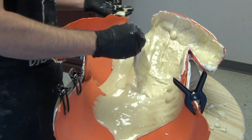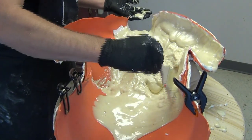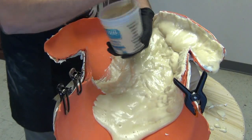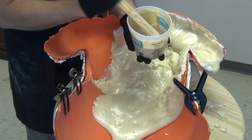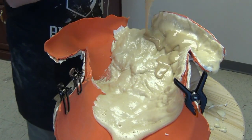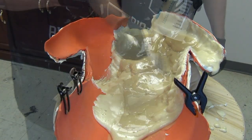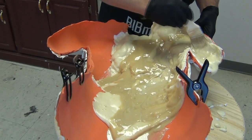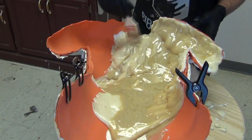Just brushing and smearing that all over the inside, then allowing it to expand, gets a lot more uniform surface where the foam meets the resin. You can have some weird distortions occur if you get a gap or bubble of air between the resin and the expanding foam — because the foam is putting off heat, it can cause that air to expand and create some funky spots on your pattern. Now this is one more batch of rigid foam. I only waited about 15 minutes to mix this second batch and pour it on the back. The back doesn't need to be perfect, but I want it to have enough substance to help me with sculpting the medical simulator later, as I'll be adding clay to the sides, back, and top to finish out a stylized section of the human form.